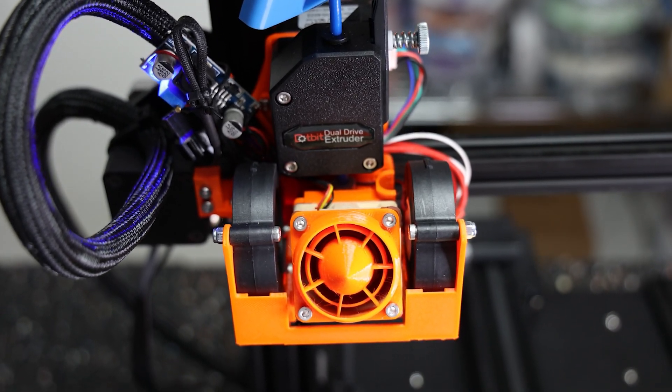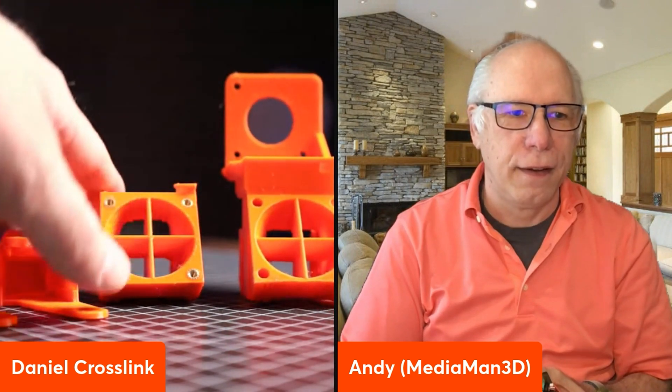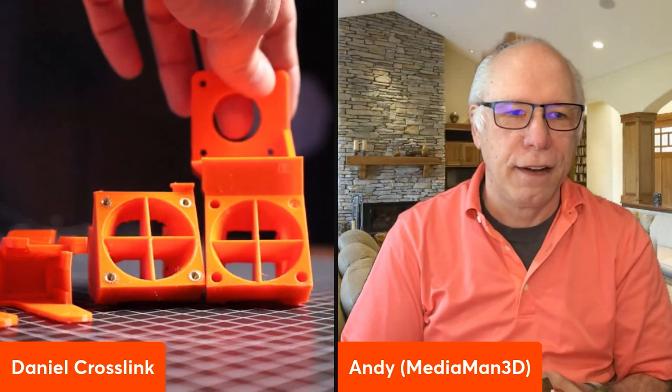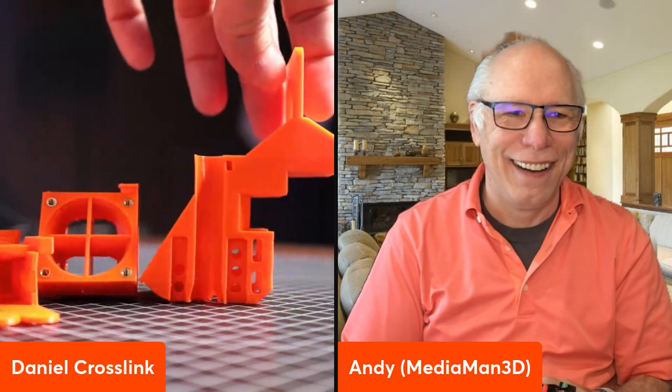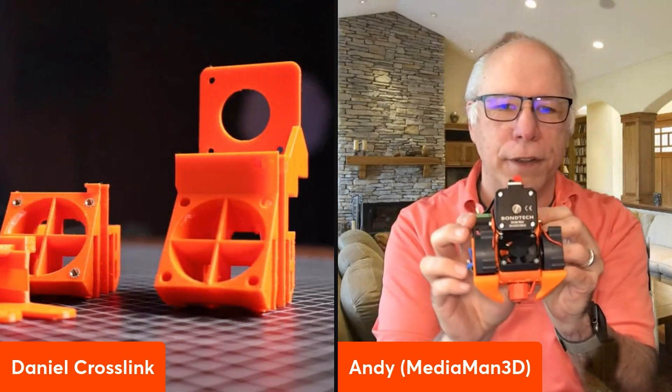I have the BMG set up on all my printers, and I brought a new HeroMe Gen 6 direct drive version. I started with the standard base and my original BMG holder mounted to the rail system, but now with Gen 6, direct drives mount literally directly on top of the HeroMe base — for example, the Bondtech LGX is mounted directly on top. So there is no flex; it is all locked in place. The PTFE tube going down is totally captive and surrounded with no flexing.